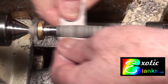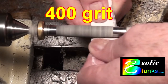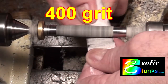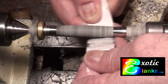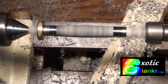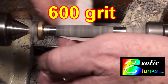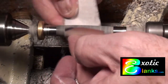So we go down to sanding it. As usual, I start out with 400-grit sandpaper. In between, I took it off the lathe and faced it with the sanding device I frequently use on camera — most of you know what I'm talking about. It was faced, and then it came back on. All I'm doing now is sanding because the ends were about right anyway. So 400-grit and then 600-grit, and it's good to go. From there I went over to the buffer — triple E, white diamond — and it was done.